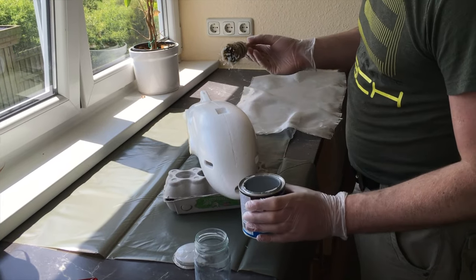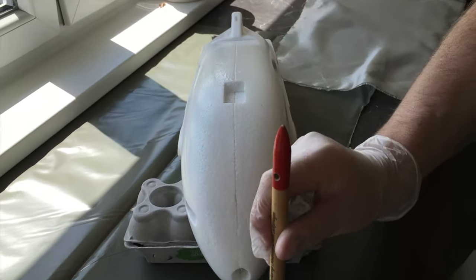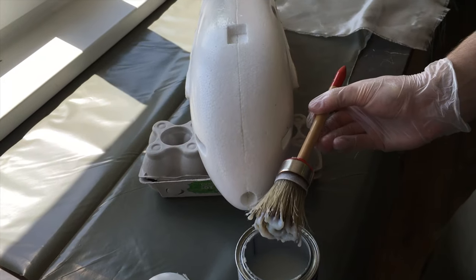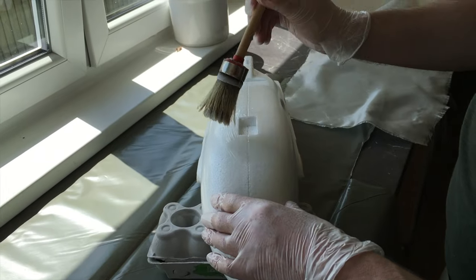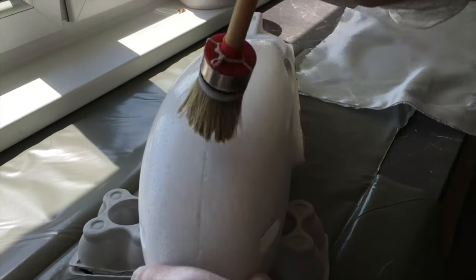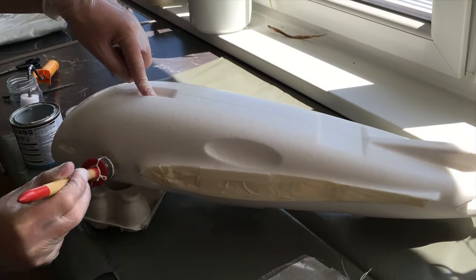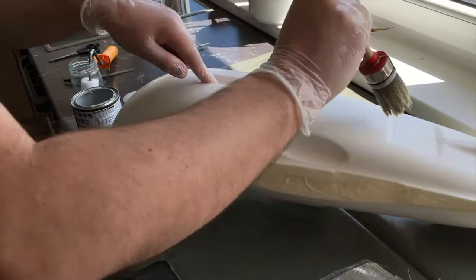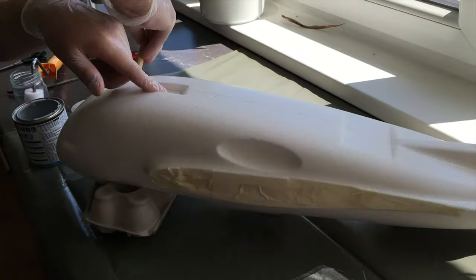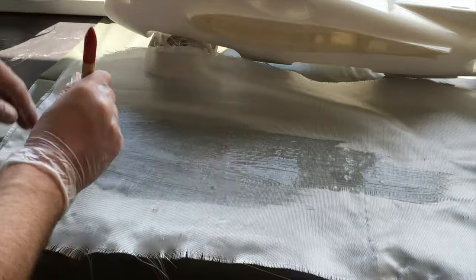The cloth used is 80 grams per square meter. This could be pretty tough. Let me show you how I did it — there's nothing special to it and the explanations come from back in 2016. It's just a basic layer. I'll provide the foam to soak a bit, get a bit sticky, as we will apply the cloth afterwards. It doesn't have to be that much, just let it soak a bit. The whole idea of putting the varnish on and spreading it out on the cloth is just to eliminate any bubbles you could end up with.